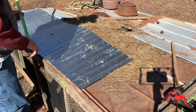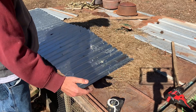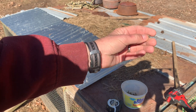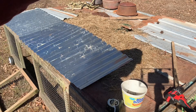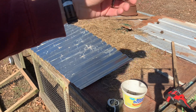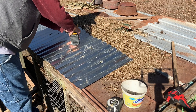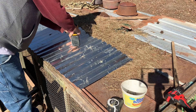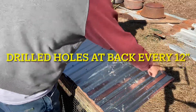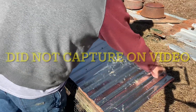Alright, so there's our 6 foot right there. You don't want to have it exactly 6 foot — have it overhang just a little bit so the whole outside of the cage is covered also. If you can, try to use these small little pan head screws. We want to drill from the top down, not the bottom up, because if not it would be hanging out and could catch some of the poop. We're going to bury it in the first hole at the top, making sure you get that very end down.